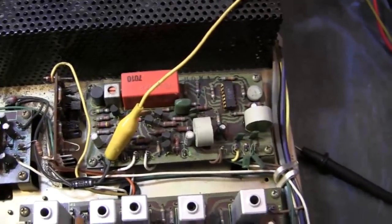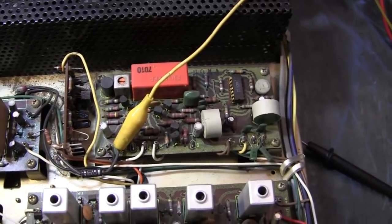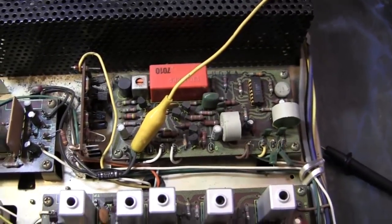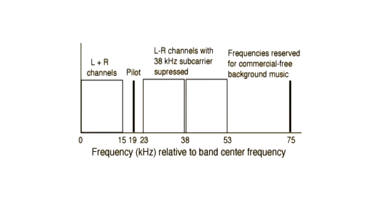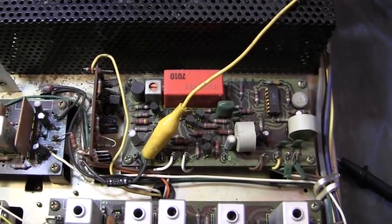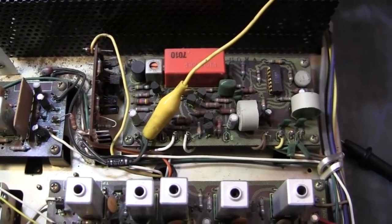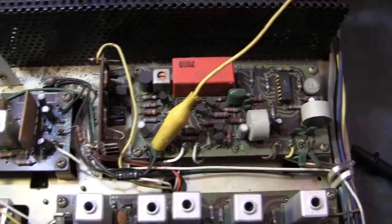And it's all just with the addition and subtraction of audio signals, even though the 38 kilohertz carrier for FM L minus R is above your hearing range. It is on a carrier, and it's an AM carrier, by the way, and once that's detected, you have the audio again, the L minus R audio. And so this is the way they came up with monocompatible FM stereo.